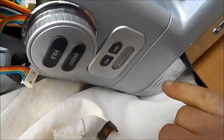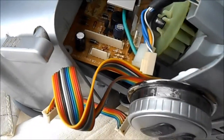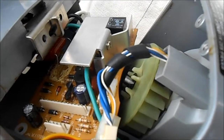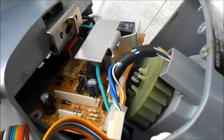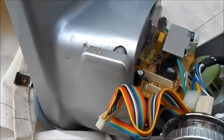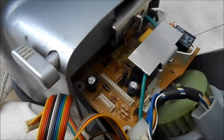On this particular mixer, what happens is it would intermittently show a readout but would never turn on. Basically, there's a small capacitor on this board — it's an orange capacitor that's glued onto the board. You have to find a replacement capacitor and put that on. You can see it back there, that orange capacitor right there in the back.